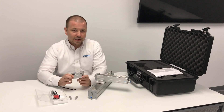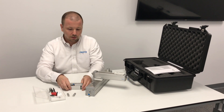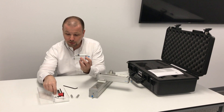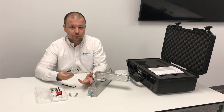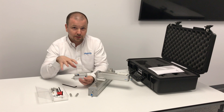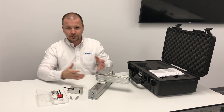Lastly, all of these actuators are protected, so they can be used in clean rooms or in dirty environments. In the demo case, we've put standard Festo fittings onto all of these actuators. This isn't how they arrive from the factory — the two ELGC axes come with a set screw plugging that hole, and the EG-SC mini slide comes with a bronze filter over the breathing port, which lets air in and out but not dirt. In clean room applications, you can run vacuum out of the actuator to keep dirt inside from escaping. Or in a dirty environment, you can run a little overpressure into the actuators to keep dirt from getting in and contaminating them, which extends the service life beyond what you'd get without that overpressure.